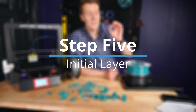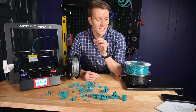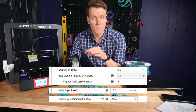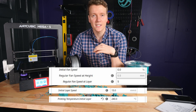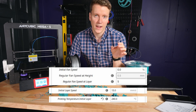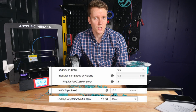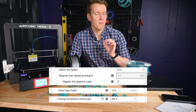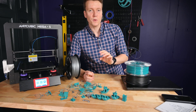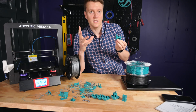Once you have a baseline to start with, the next thing to tackle is your initial layer settings. I use Cura as my slicer and with that you can adjust the initial layer's temperature, speed, and fan settings — all three of those need to be adjusted for PETG. I needed to greatly slow down the speed; printing around 15 millimeters per second worked really well for a first layer. Turn the fan speed off — I have it off for the first five layers of the print so the plastic sticks really well to the heated bed and you won't have as much issue with warping. I also found if I print the first layer about five degrees hotter than the rest of the print, it helps the plastic stick really well and get a good solid first layer. So much of 3D printing is getting a good first layer — if the first layer fails, the entire print is gone.